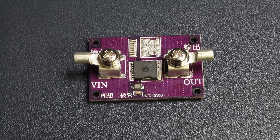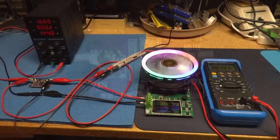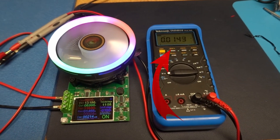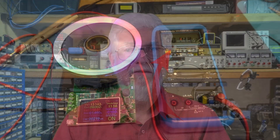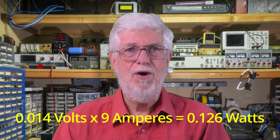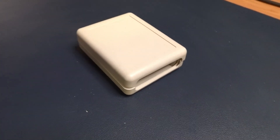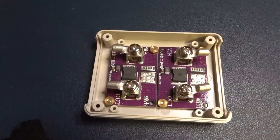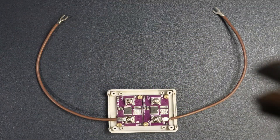So I bought a couple of them and tested them. With a 9-amp load current — close to the limit of my power supply and near the max load I really expect — the voltage drop in this circuit is only 14 millivolts. So this circuit is only losing an eighth of a watt, compared to over 6 watts for a conventional diode. That's close enough to ideal for this application. There obviously needs to be some protection for the exposed terminals — this little plastic box costs less than a dollar from AliExpress and holds both of them perfectly. With the addition of a couple of jumper wires, this is ready to be inserted in the existing switch wiring in the camper.